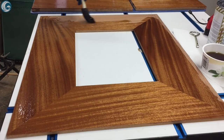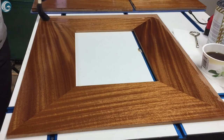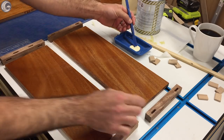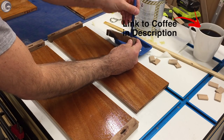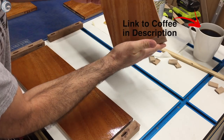I finished the underside first with four coats of Epiphanes varnish to waterproof the surface. Once the insides of the panels were fully finished, I assembled the sides, starting by gluing the legs of two of the sides, and then assembling the last two panels to complete the base.